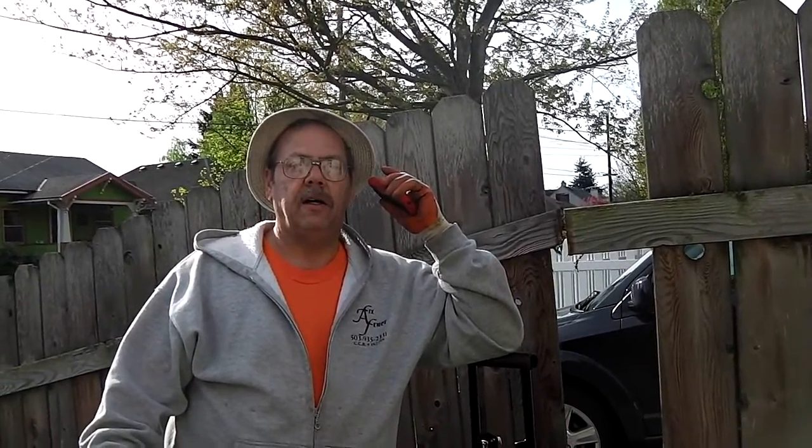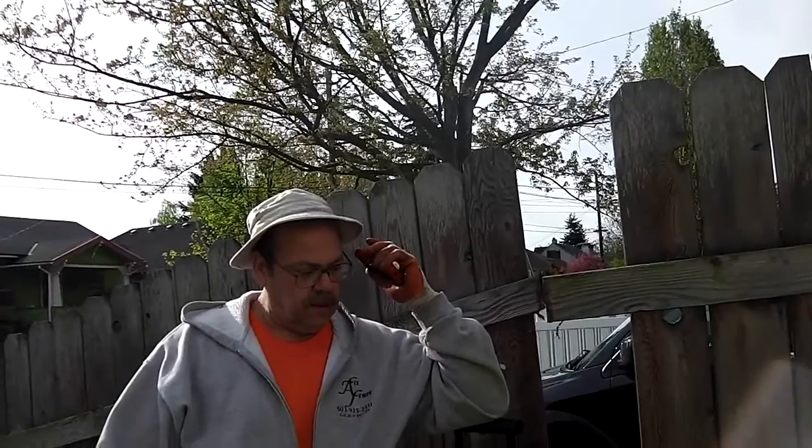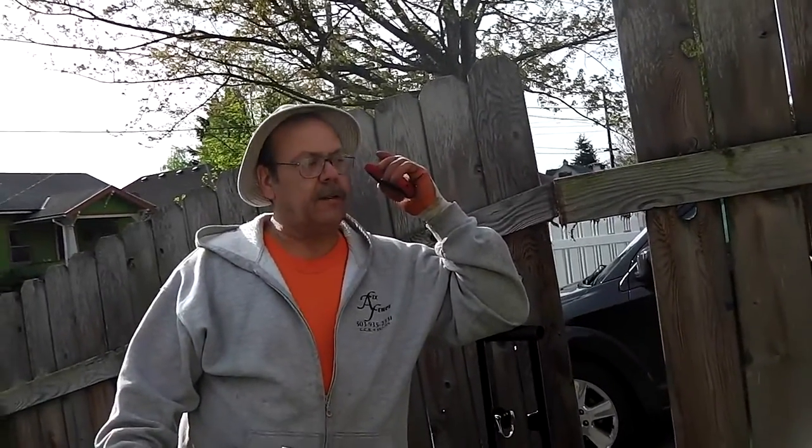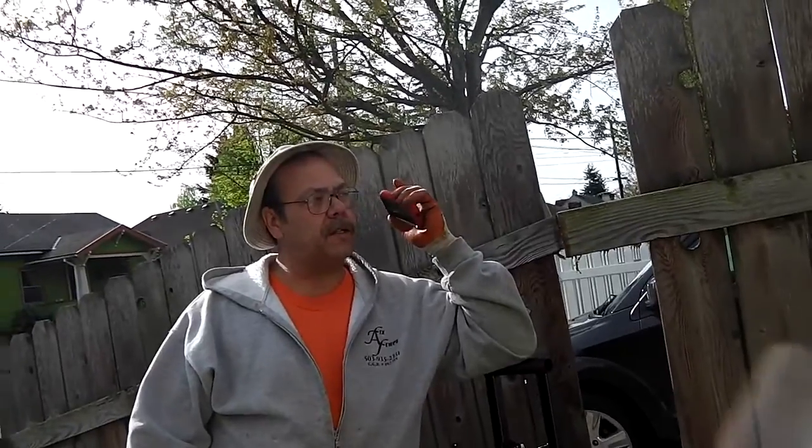So you can pull the concrete straight up when your post is ripped off, like you had last week. So you're not pushing against yourself, against the dirt on the other side. Right. You pull up one, you pull 180, pull up there, and then maybe one across, and it'll just come out. Got it. Okay. Good advice. If I got any more questions, I'm putting this to the test, dude.